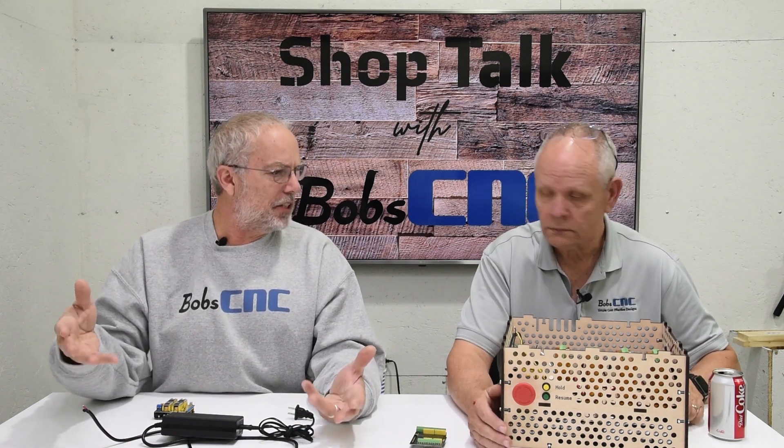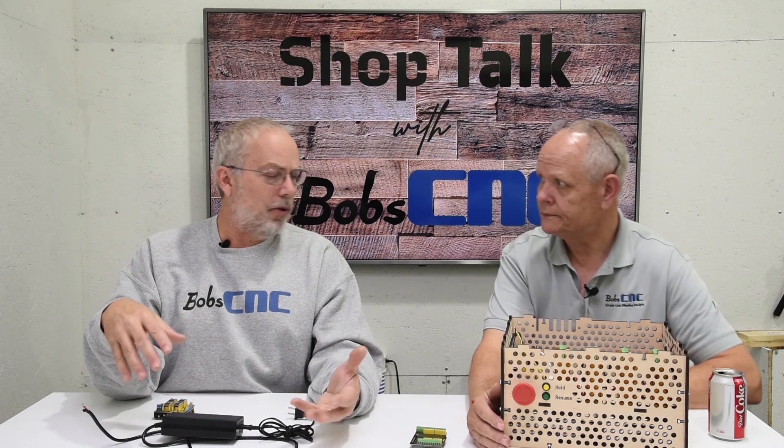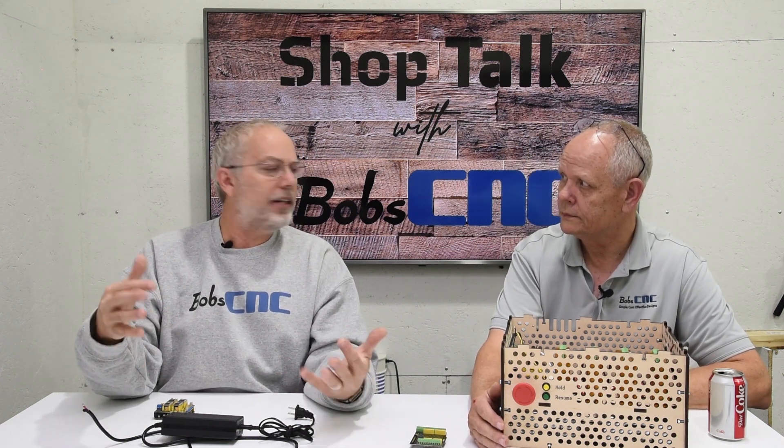Actually, we'll cover the difference between the E3, E4, and the new KL series. The first thing you need to know is it doesn't matter if you have a CNC machine that has one axis or six axes — you need a controller to take those computer on/off bits, step and direction in most cases, for all of us hobbyists, to get it to move the machine around.